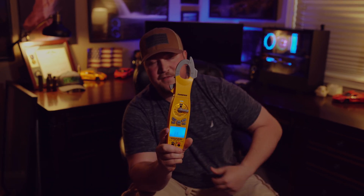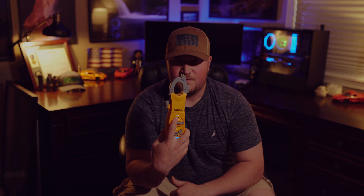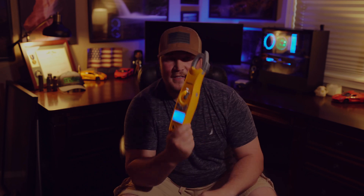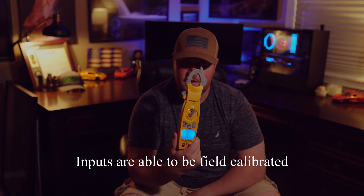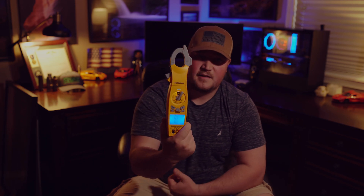Next you've got NCV — non-contact voltage. It works from 24 volts AC all the way up to 480 volts, and it worked on everything I tested it on. It eliminates the need to carry around a secondary voltage stick — as you get close to it, it starts beeping and flashes a red indicator letting you know it's live. Then you've got microfarads for testing capacitors, and temperature — there are actually two dual temperature inputs, two Type K thermocouple ports. That's another big reason I purchased this particular meter, as this thing kind of does a whole lot of things in one, including the ability to take dual temp readings.